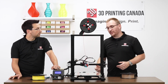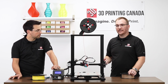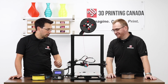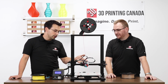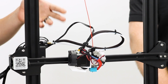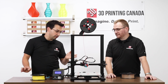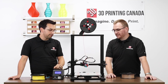And when it happens, you will hear a sound like click, click, click. Normally the extruder is trying to pull out the filament and it's just grinding the filament where the gears are. But yeah, it could be clicking because it's skipping steps. It could be the noise of the gear grinding against the filament. Yeah. And usually when that happens and you get it all straightened out, you're probably going to have some shredded filament bits inside your gear assembly, your hob bolt area. So you might want to blow that out and make sure that's all clear. In the case of a Bowden setup, that would be at the back corner here instead of at the hot end area. Exactly.